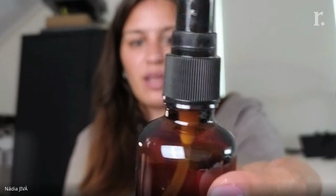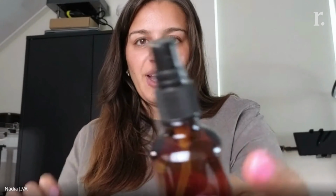We normally put it in spray bottles, because to burst the bubbles, if you have your mix, you can just lightly spray from about 10 centimeters away, more or less like this, and it will burst the bubbles on the top. So this is a very cool trick, the isopropanol. Thomas already wrote it in the chat also. More things that we use.